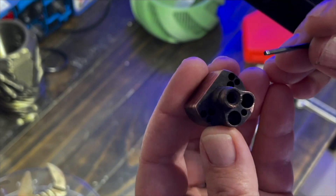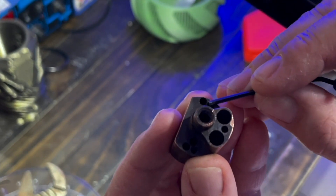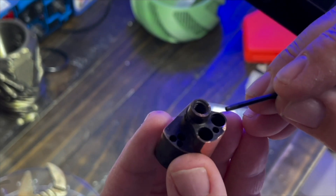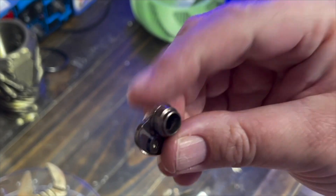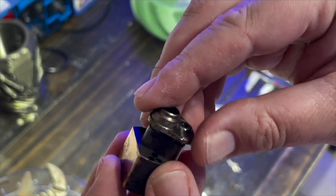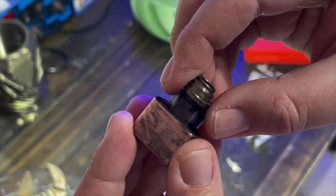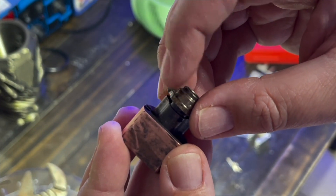On the bottom, this is where the two heaters stick out, this is where the thermistor sticks out, and this is where the nozzle goes. This nozzle shield piece is a pretty cool little piece — it eliminates the need for a heater block sock to prevent the fan from cooling the nozzle. It also keeps the nozzle relatively clean and keeps the airflow right off the top of the block.